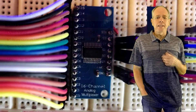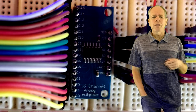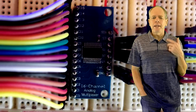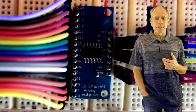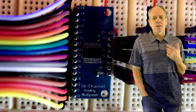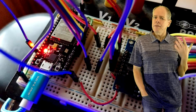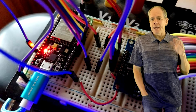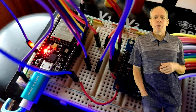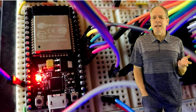A CTC panel with a maximum of 8 activated buttons may not be what most of us are looking for. So I wondered whether it would be possible to use an analog multiplexer to make each input line into 16 different ones. I picked the 74HC4067 MUX and connected it to one of the GPIOs, then added the MUX library to my sketch so I could select individual inputs. A first test showed that the untouched value came down from around 80 to between 15 and 20 because of the capacitive effect of the multiplexer — that was to be expected, even though I hoped it would be less.